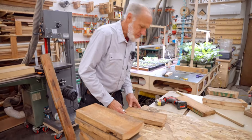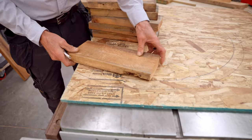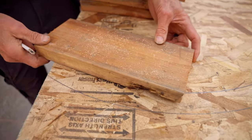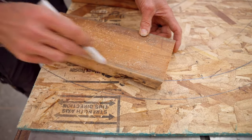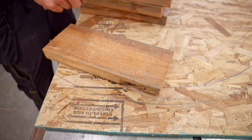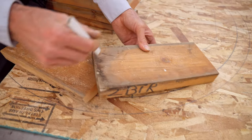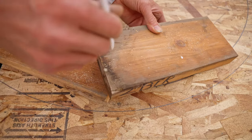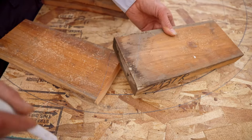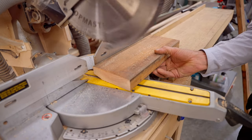So then the next thing is just to put them — I'll do it on this side so you can see it better. You see that this is the arc here. So you just put this edge, just so it just covers the mark — we're going to cut this radius on this piece of wood just so it covers that mark. And then you can just kind of put another one like this. You can kind of see you want to split this angle and just get a rough idea of the angle. It's not precise at all. Well, that's what makes it easy. So we'll just cut an angle on this piece here.